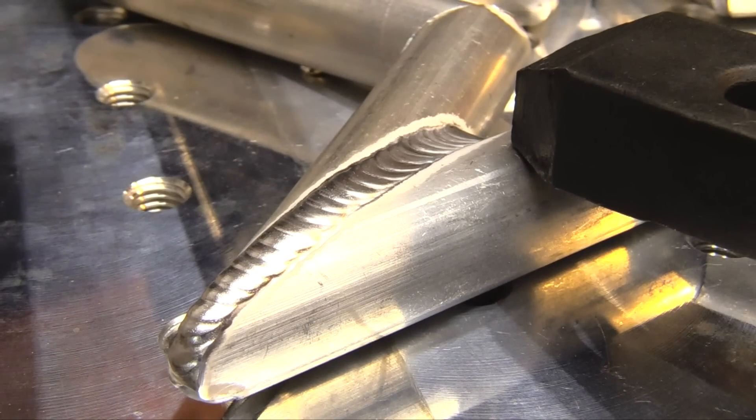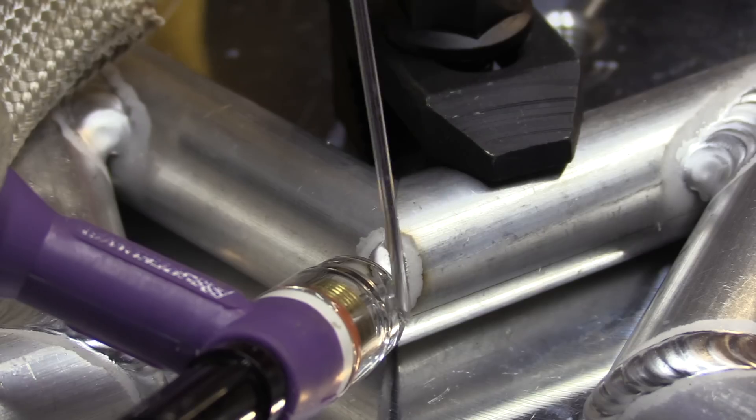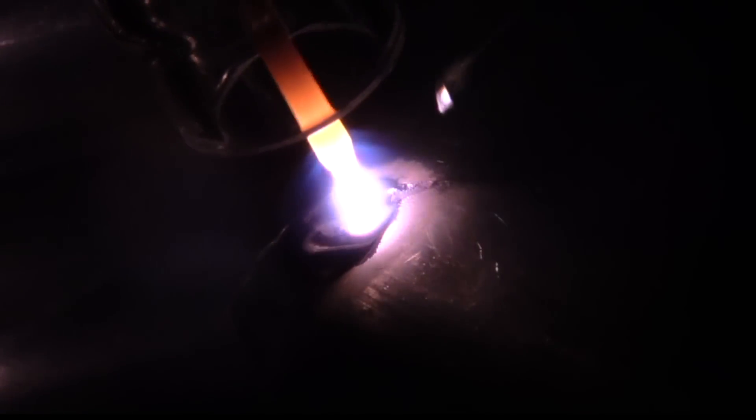Those angles were kind of fun — a little challenging at first. The tighter curves are actually more challenging and harder to make look good, because you really do have to change torch angle almost every dip to maintain a good angle. I'm pulsing the pedal a little bit, adding a little less filler when I get over a tack to try to make things even out. I'm letting off the foot pedal enough to give myself a little time to add rod. I'll show the welding down in the tight areas a little later — my torch angle is a bit out of scope there and the fixture is in the way — so I'll weld those last when it's out of the fixture where I can access them. By that time everything will stay nice and flat.